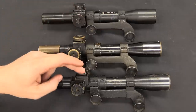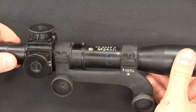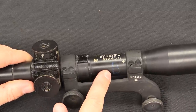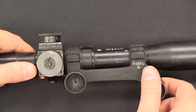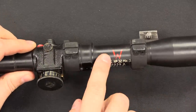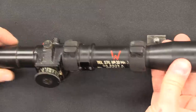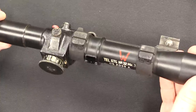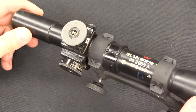The elevation is not in minutes of angle at all — it's a bullet drop compensator, a range adjustment with 50-yard increments from 0 out to 1,000 yards. This blue painted B is for blooming — a modification done to improve light transmission in the scopes for low-light conditions. This scope is also marked with a red painted W, meaning it was treated after production to make it more waterproof, as these tended to have problems with moisture getting in and fogging. The British made an effort during and after the war to improve the waterproof qualities of these scopes.